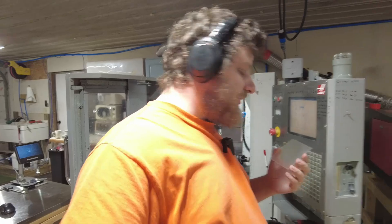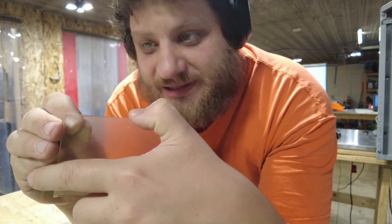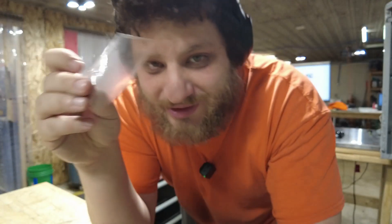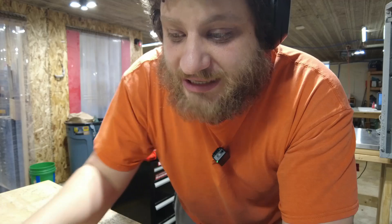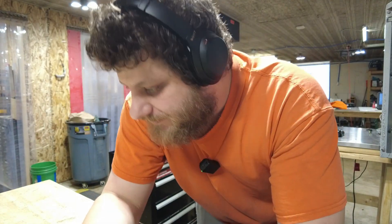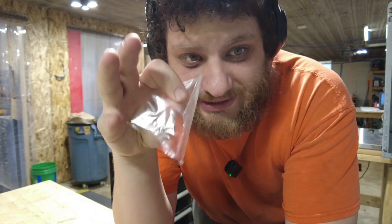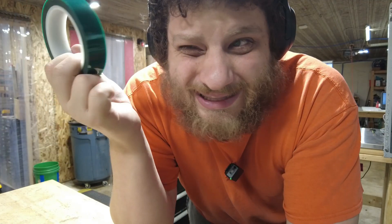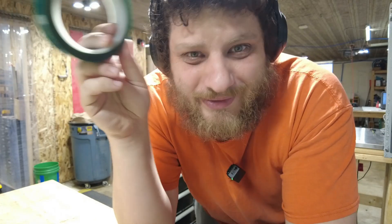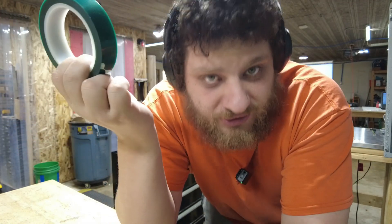This next step may seem a little weird — the material has a nice layer of protective plastic on it, but I'm going to take that off and replace it with tape. The reason, learned through trial and error, is that the factory film is very gummy and gets tangled up inside the end mill when you cut all the way through, causing process reliability issues. The blue tape, on the other hand, is harder and more brittle — it machines much more like the acrylic itself, coming off in chips instead of wrapping around the tool.